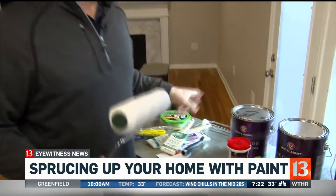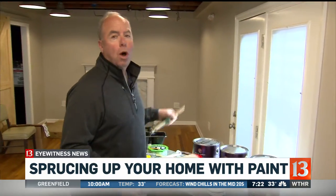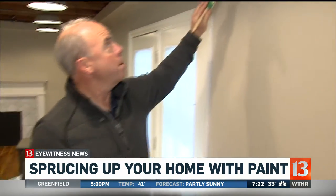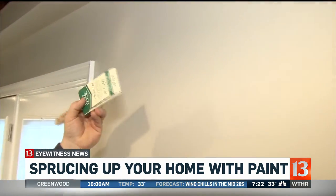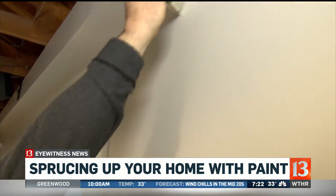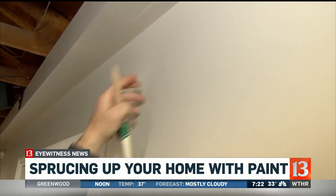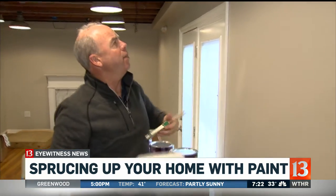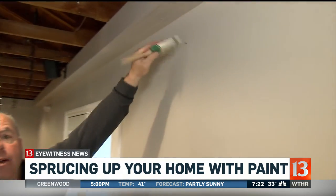Once you've done your prep, you want to trim out. You always do the ceiling first, then the walls, then the trim. Some professionals reverse that, but don't worry about what they're doing. When you trim out, the main thing is you always want to feather your paint down — if you just lay paint and leave a thick ridge, that's going to show up in your finish. Make sure you feather everything out; feathering is just pulling it down like that.